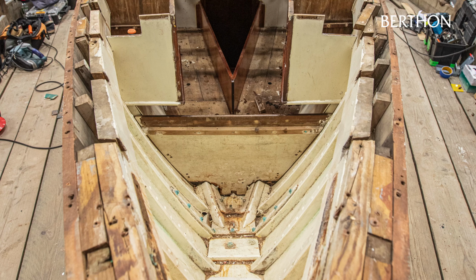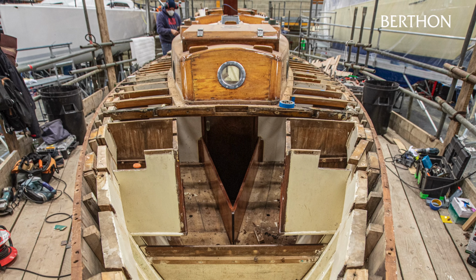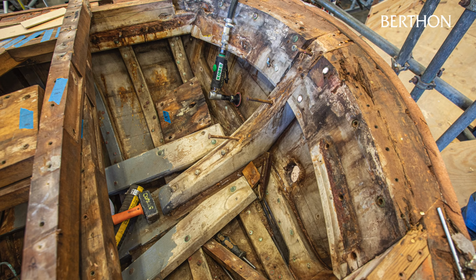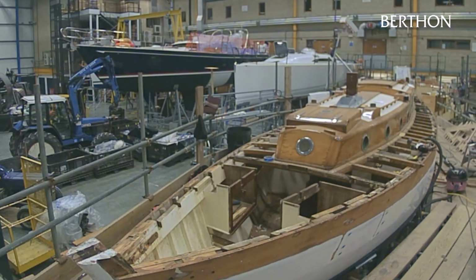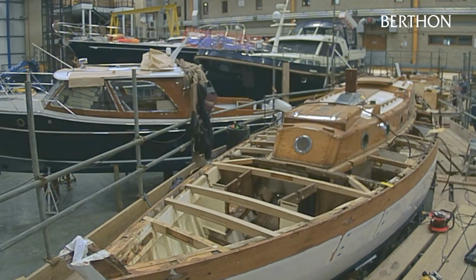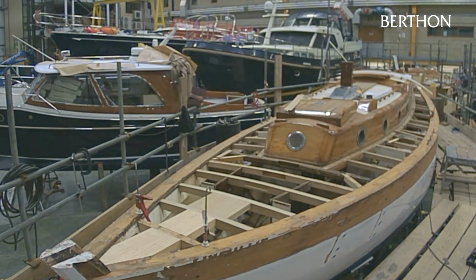Most yachts have many small areas with poor ventilation. Under the aft deck, for example, water can easily find its way through a traditionally laid teak deck and become trapped in the complex structure beneath. Fresh water is the worst, and it doesn't take much over a period of time to encourage dry rot.